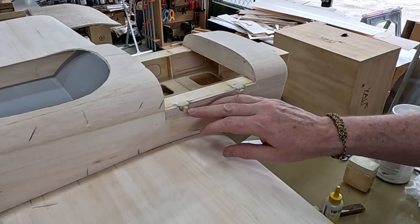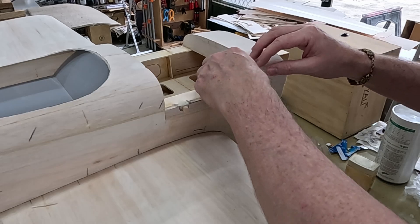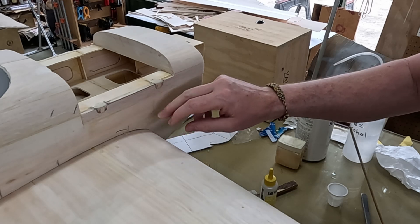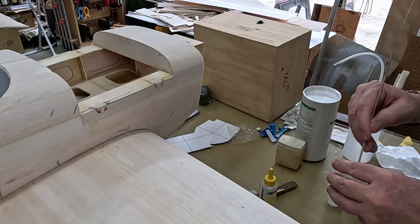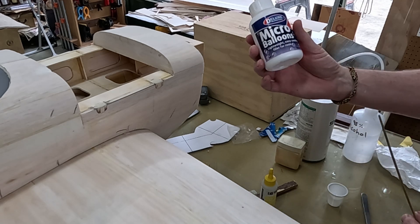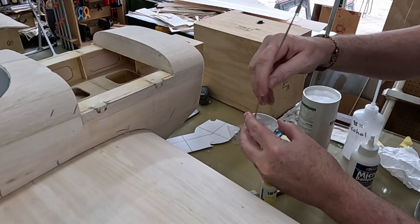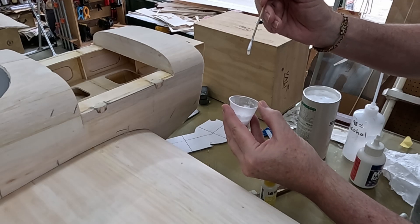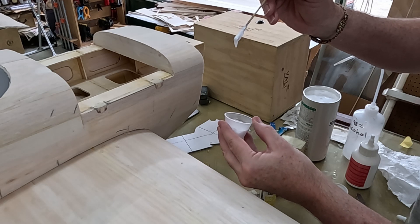As expected, that got glued to the hinge — but that's okay, this is going to be part of the infill anyway, so it's easy to sand. While I'm waiting for this epoxy to fully cure, I'm going to go ahead and fill in the recesses. For this I'm going to use a finishing resin mixed with some micro balloons. I want to mix it just to where it won't drip off the bamboo skewer — and that's what I'm looking for.